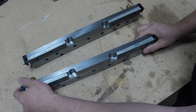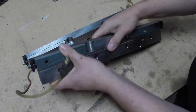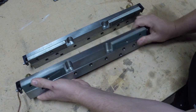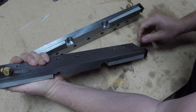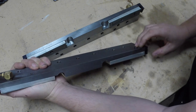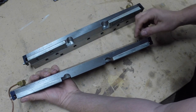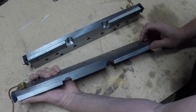The way lube comes from this line here, in through this hole, and is distributed through this groove here. I also noticed there's a port here for way lube, but it's closed with a set screw. I'd also like to know, if you're a Fadal owner, whether on your machine this port is connected to the way lube system — I'm thinking of adding way lube here.